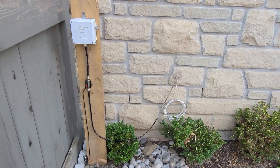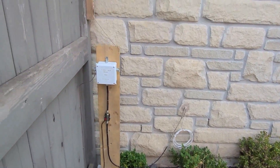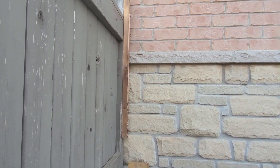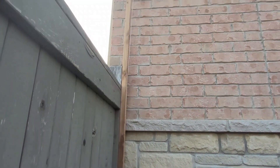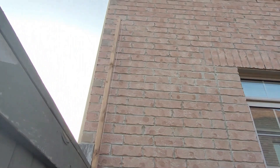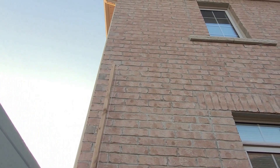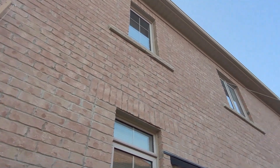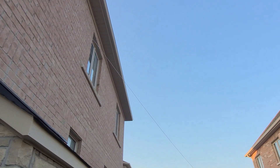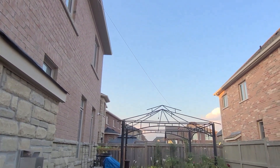Here is the video of my 71-foot random wire antenna system, starting from the ground rod, moving up to the lightning arrester, then to the transformers. You can see I used a 2x2-inch by 8-foot pressure-treated lumber to elevate the antenna element from the ground. At the top of this wood, I installed a carabiner to guide the wire to the other side of the fence. For those wondering what kind of wire I am using, I am using a number 22 gauge speaker wire.